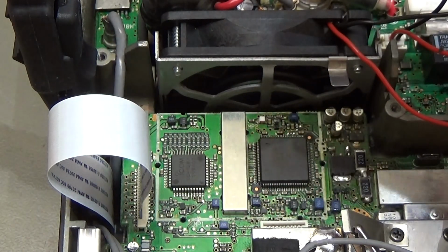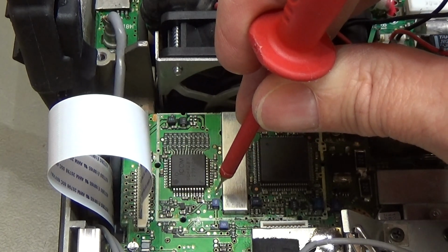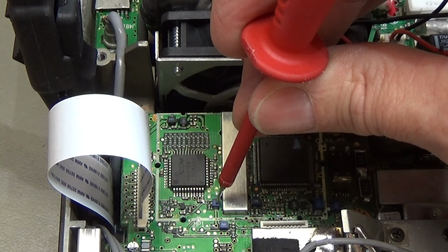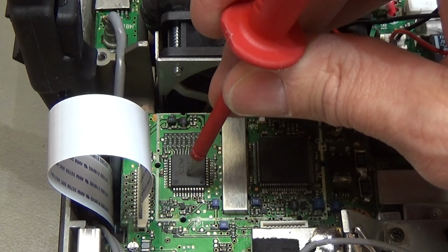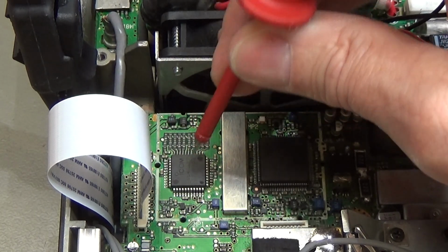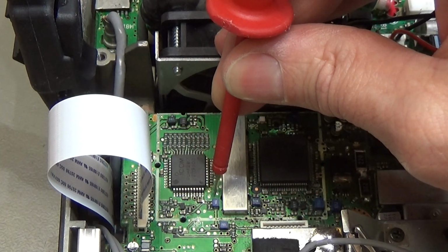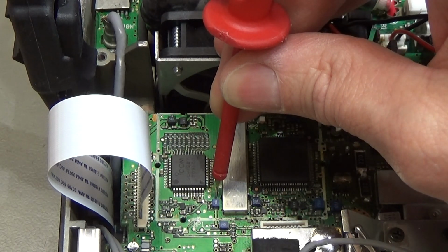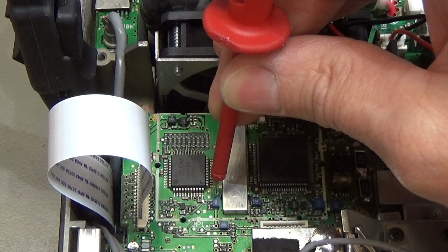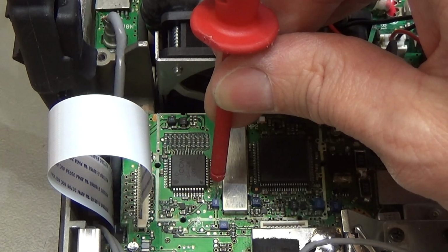And well, if we are lucky, then this little coil gets destroyed by, I don't know. If we are lucky, nothing has really happened to our IC, but it might be that there is a short, and therefore let's see what we have when we go here to our supply line. Yeah, and that is a dead short. That is really bad news.